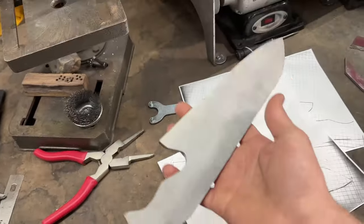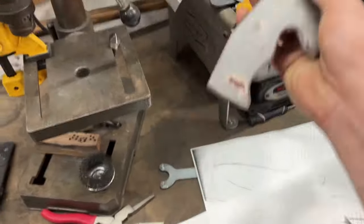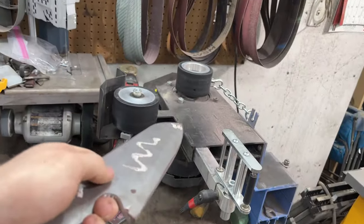So what do I need to work on now? This blade is way too thick. It's at a quarter inch, so 250 thousandths. I need to bring this down to 200 thousandths for now. Then after heat treating, I'm going to go to 180 thousandths. But right now, bringing it to 200 thousandths. So that means it's belt grinder time.